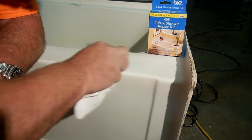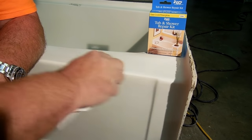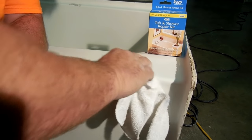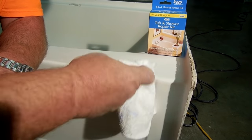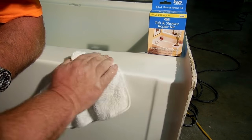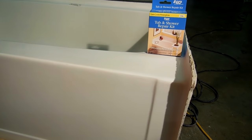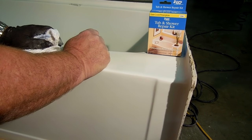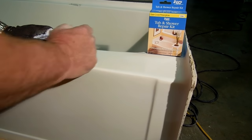As far as the repair color, there's always the possibility it may not match perfectly because manufacturers get a different batch of gel coat about every six months, and that new batch may not be identical to the previous one. But the object of any repair — from a professional standpoint — is that someone who doesn't know it's been fixed can't just walk in and see the repair. This one has come out exceptionally well. This repair kit from Gelco Products works really good. I've picked it up at Menards, and having done repairs for a long time, this one here works great. That concludes it.